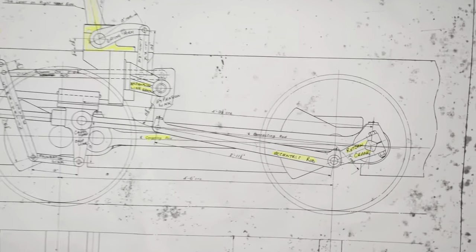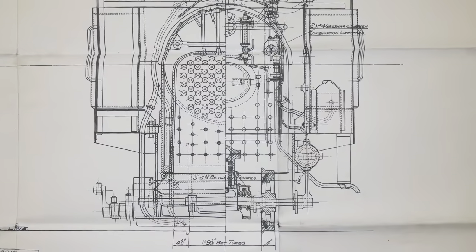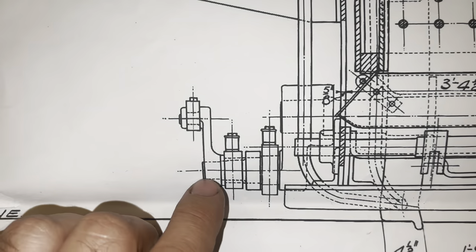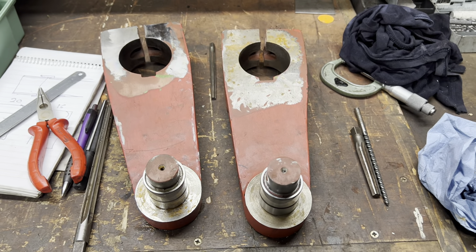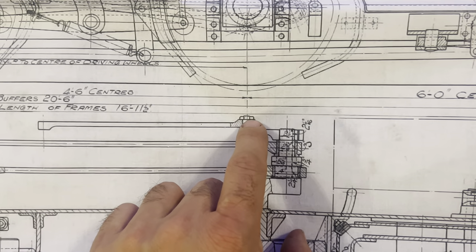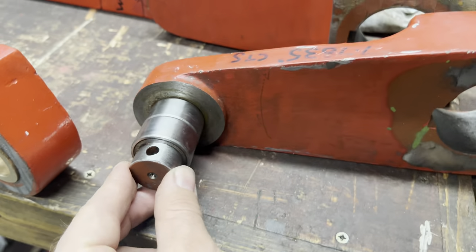This is the Bundaberg drawing — a general arrangement from the side of the valve gear showing how everything comes together. Now moving to the return crank — it has a square crank on the Bundaberg but a round pin on the Fowler, just an alteration in the design as progressed by Bundaberg. Looking from the back of the locomotive, you can see the return crank which translates the round motion from the crank pin into the pin for the end of the eccentric rod. We turned the pin down and put on bearing shells, which gives a very accurate hard surface.